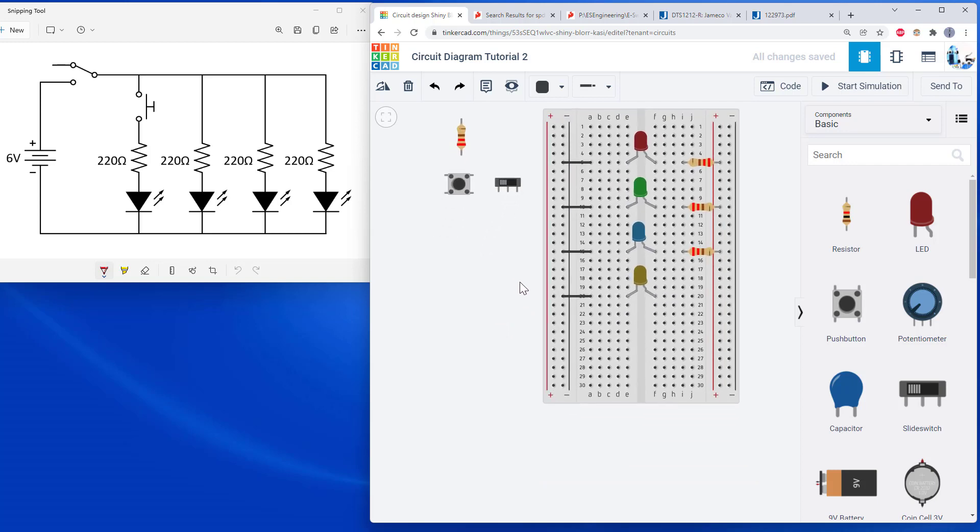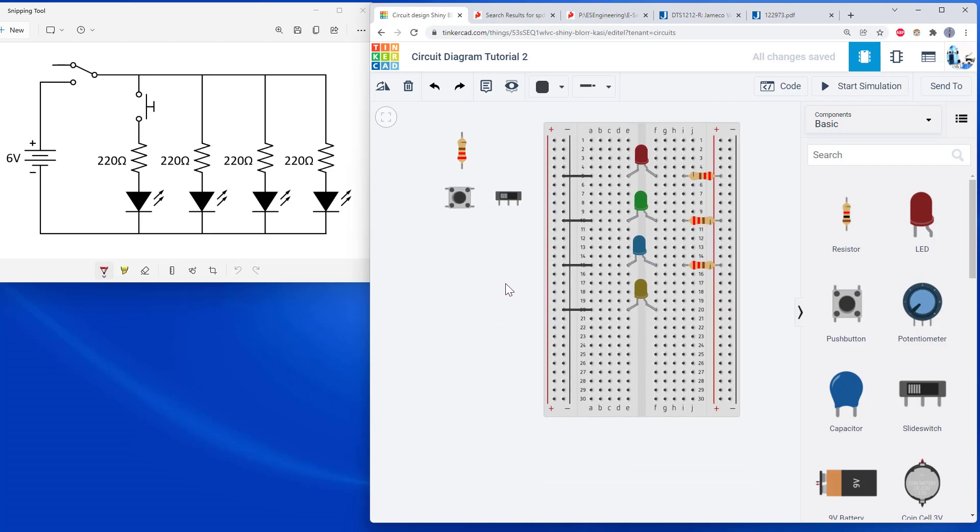When using a single voltage supply, a single battery pack, you usually want to connect the buses on the left and right side of the breadboard so power and ground are easily available everywhere. I'm going to connect my left and right ground buses and my left and right power buses, using a red wire for power — the color we usually use. Now I have power and ground available everywhere on my breadboard.